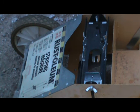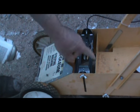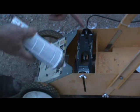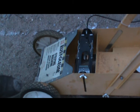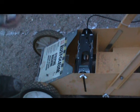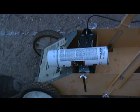Additionally, this carriage that holds the can is adjustable with two wing nuts on the side for up and down for a width of spray pattern, down to 2 inches to 4 inches. Well, I got it all the way up to 4 inches, which looks about what I'm going to be needing for this parking lot that I'm doing. It's only a matter of 6 lines, but still, I've never done this and I don't really want to mess it up. So that's where we are. I've got to go drive to the parking lot now and set this thing up and get started.